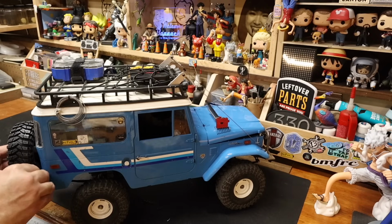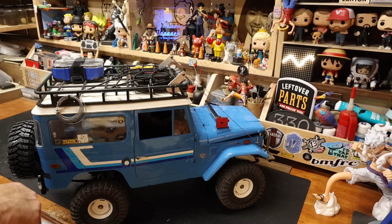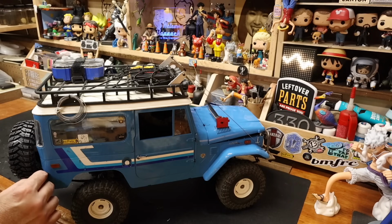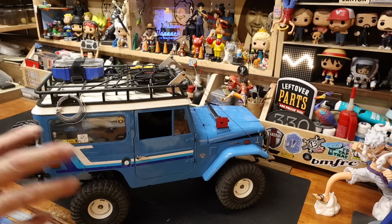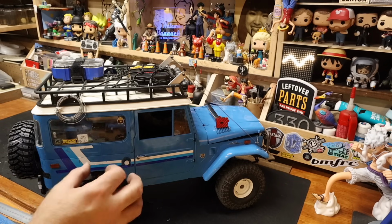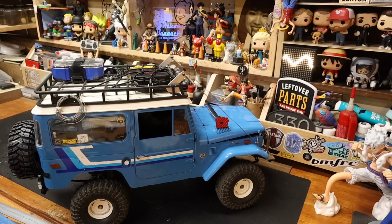And if anyone has an idea, we've got a hole 17 millimeters deep. We can't penetrate all the way through the hole because the light bucket is right under the other side of it. It is drilled out to 3 millimeters. We don't have a huge amount of meat on the other sides of it. I mean, I guess I could just turn something on the lathe. I could make a new pin that really fits tight. Get myself a 3.0 millimeter pin to really tighten it out. But if we ain't gotta, we ain't gonna. And that's how that works.